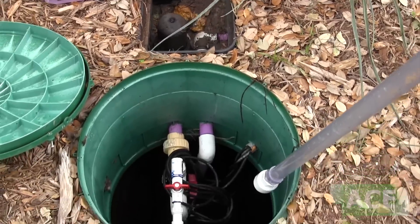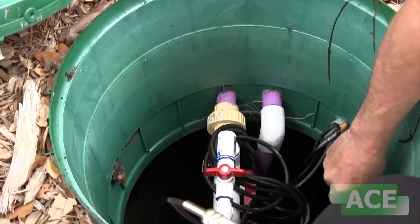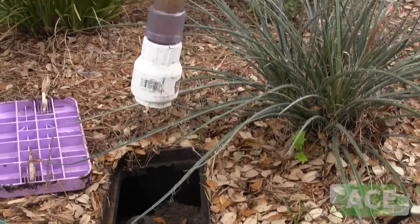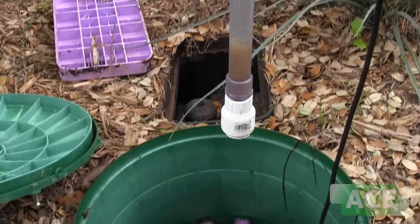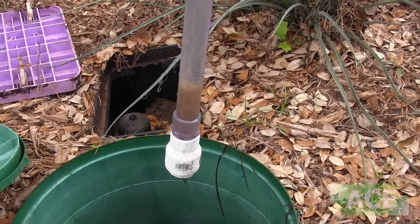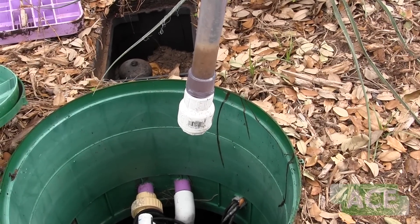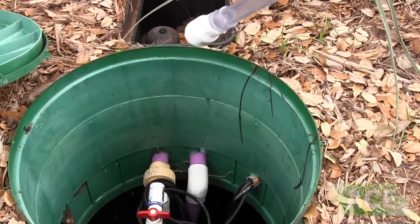I'm going to take a sludge judge test and show you what the sludge level looks like. As we can see, this is supposed to be clear water and it's mostly clear, and then at the bottom we have a little bit of sediment — it's not much. This particular pump is a mid-feed pump and so the worry threshold is at nine inches. This reading is only about three inches, and the sediment is still moving so it's going to settle down some. We release that inside the tank — that's how we check the sludge.